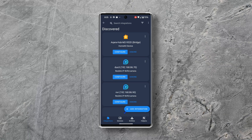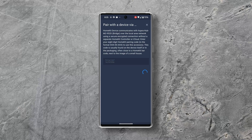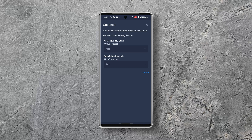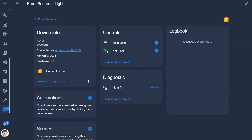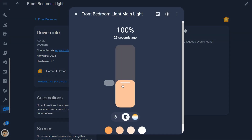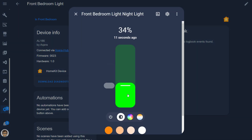There are two ways to add this to Home Assistant. The first is using the Aqara M2 hub — once your light is connected to the M2 hub, you can add the hub and any connected devices to Home Assistant using the HomeKit Controller integration. The hub will automatically be discovered by Home Assistant and you just need the HomeKit pairing code from the box. Once the hub is paired, the T1M is automatically discovered in Home Assistant. The controls allow you to set the brightness and warmth of the main light, but it doesn't let you set any of the special effects for the ring light — you're stuck with a solid color and brightness.